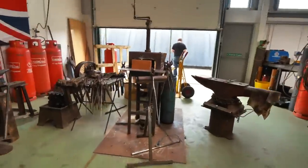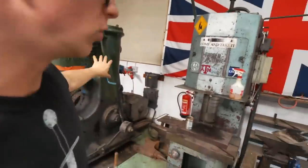Now that I like the pattern, I think we're gonna stack that up again and weld this into a billet. I want to stack it up four or five times and weld it, but I'm gonna weld it without a handle — just weld the billet from there, then draw the axe out of it. That's gonna distort the pattern a good deal, but I think we'll keep enough of these W's that it'll still be interesting. So I'll stack it up in five, but first I'm gonna light the forge so that it's hot by the time everything's cut up and we're ready to start forge welding.